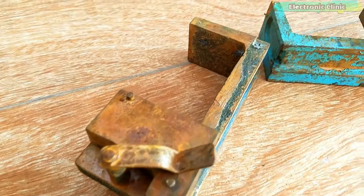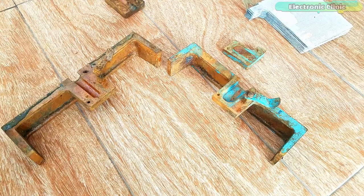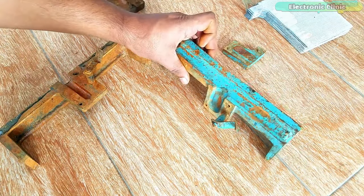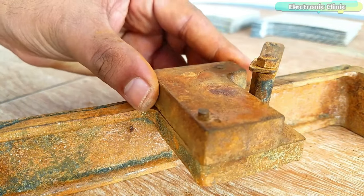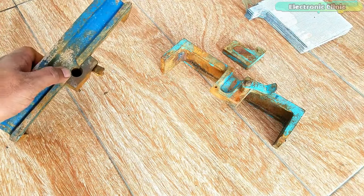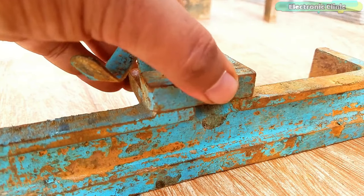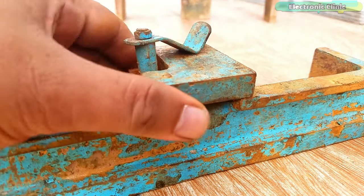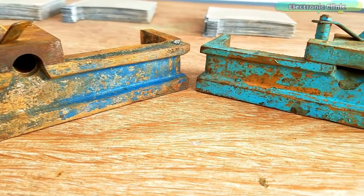The Amazon purchase links of all the materials and tools used in this video are given in the description. You will need these metal dies for making the positive and ground plate terminals. This metal die is used for making the main internal positive and ground terminals which are connected with the battery external positive and ground terminals. This other metal die is used for connecting the positive plates and ground plates, and is also used for making the terminals for series connections. These two are the most important tools that you should have.